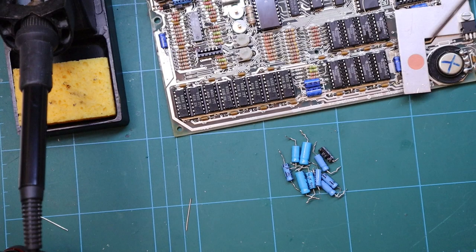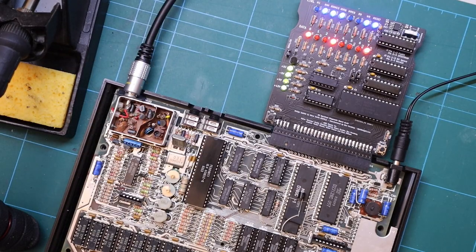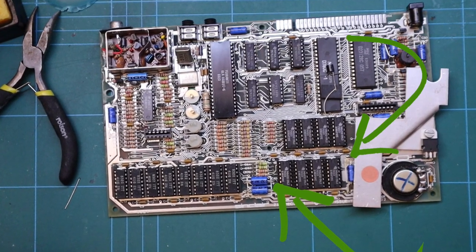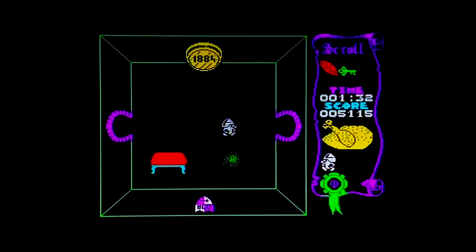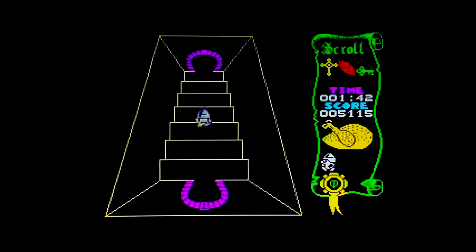I've replaced all but one of the capacitors — you'll find out why in the next video. But right now it's time to test. I'm making sure there are no solder splashes and no component legs left on the desk, then powering on the circuit board with a diagnostics cart. Everything looked fine — well, it did for about an hour. I set it to soak memory test until a rather ominous error popped up stating that all the RAM chips had failed. On closer inspection there was one dry solder joint on the 100 microfarad capacitor, and one solder joint wasn't great on C47. After allowing the Spectrum to cool, reflowing the joints, and testing the RAM, I fired it up again and all was well. It should be noted that these capacitors really do need good connection on both the top and bottom of the board — without this you can have strange issues just like I did.